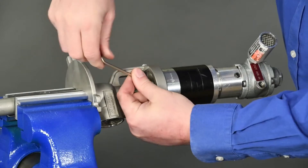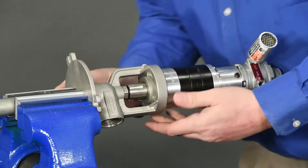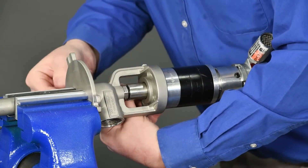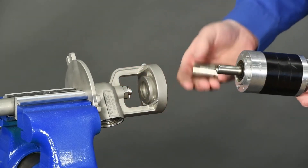The only tool that we will need is an M5 Allen key. With the complete unit removed from the tank, we begin by removing the two socket head cap screws connecting the air motor drive assembly to the inlet body using an M5 Allen key. Slide the air motor drive assembly out of the inlet body. The coupling can then be removed and set aside.